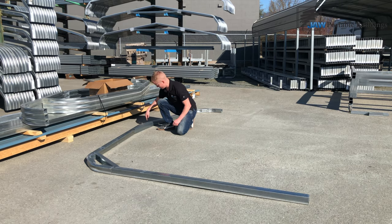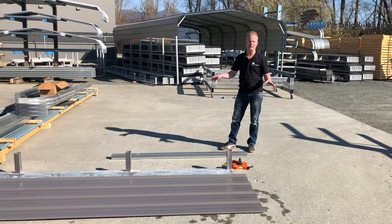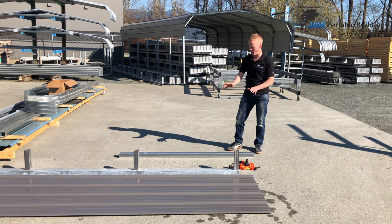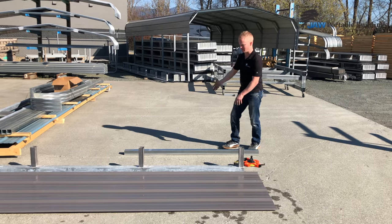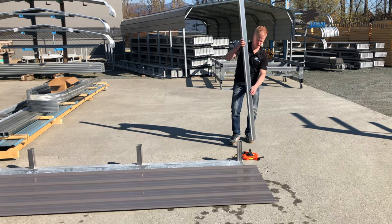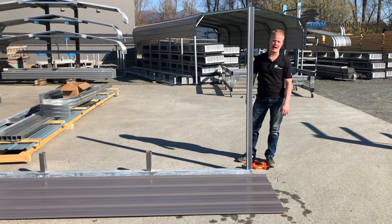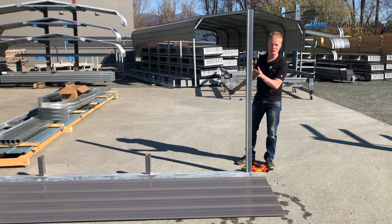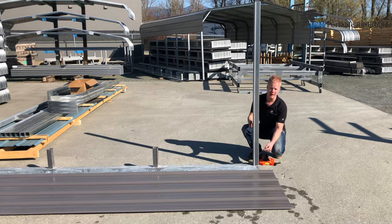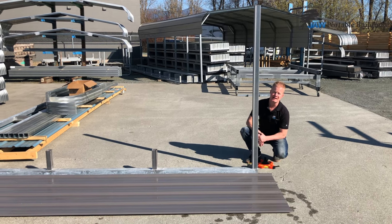Same application — put a screw here and here as well as on the opposite side. At this point you have all your rafters and legs attached to each other, set on the side. Get one person on each side, stand your frame up with your rafter, come over to your base rail, and slide your post right over top of your dowels. That completes this hoop — do the same thing the whole way down. Then grab one of your self-tapping screws and put it in this side as well as the other side. The frame is then standing.